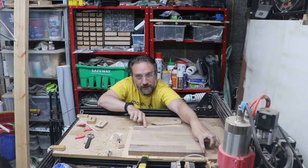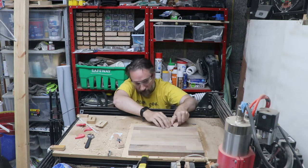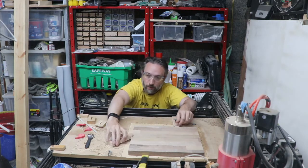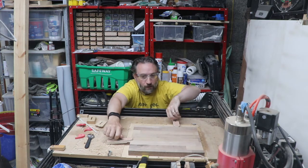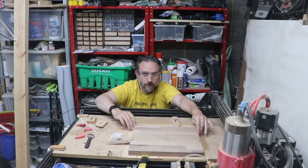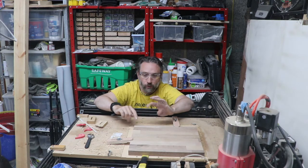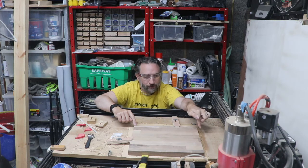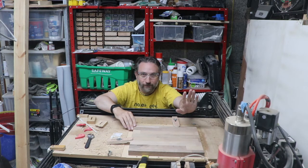I have zero on the machine set for this corner. I have a couple of these little clamps that I knocked up rapidly just for exactly this job, just to make sure I could hold it from the right places. So it's a simple setup. By machining that flat recessed section, I make sure that I'm definitely getting this square to the axes of travel. It gives me a nice little locator to make sure I get that even spacing, so all of the slots on all of the shelves will definitely be relatively in the right place with relatively fast setup.